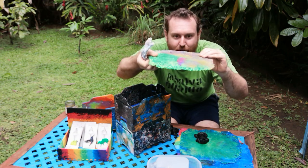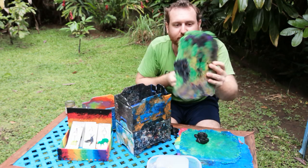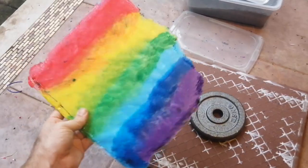That's enough that if they're just laying out, they'll start curling up. And that's not ideal if you're trying to use these as perfectly flat sheets. So you want to squish your melted plastic right out of the oven as soon as possible.